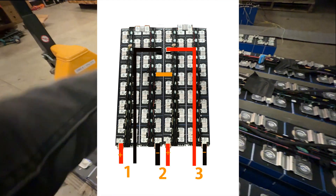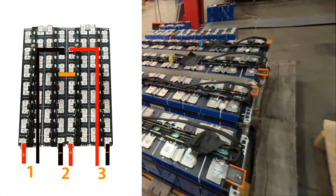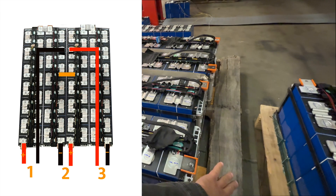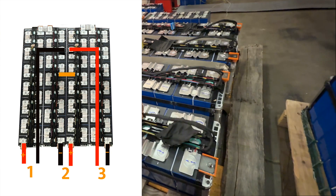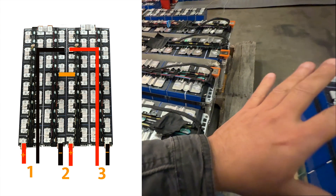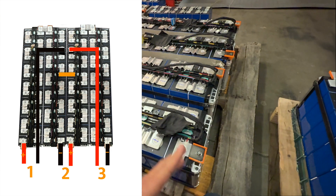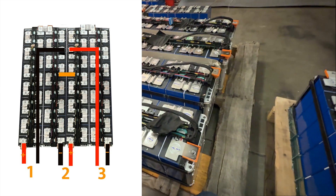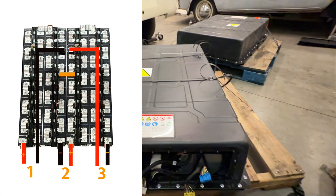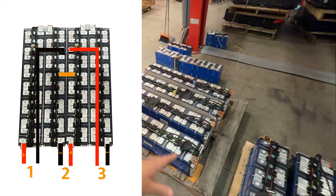Then you have four cells left in there. What you do is run cables out to the front separately and you can use three JK BMSs, one per module. Or if you want, you can rewire everything and parallel all three modules into one and use a single BMS — that's very possible and doable. You just have to connect those cables. Or you could treat these as three independent 16-cell battery modules inside this box. You can use two or three BMSs and then parallel those outputs after.